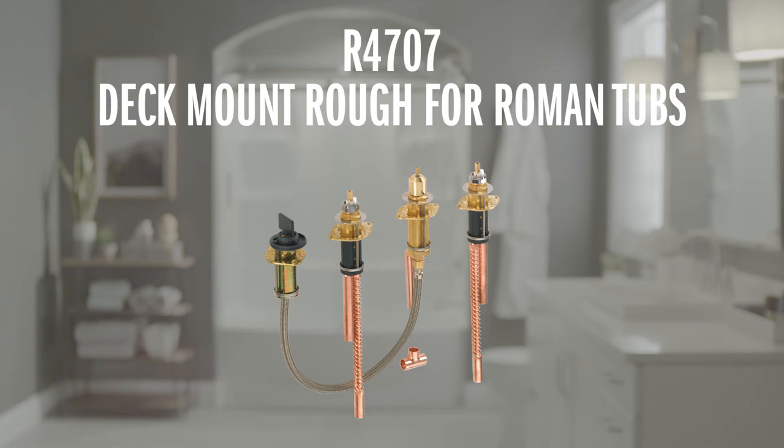Now with this type of rough, the thickness of your deck can change the installation steps, so take a quick minute to estimate what your total deck thickness is. Total deck thickness means from the bottom of your framing to the top of your finished deck surface — anything like tile or solid stone. If the thickness of your deck is more than two and a half inches, you have what we call a thick deck. I have another video specific to thick deck installations and that's the one you'll want to watch.